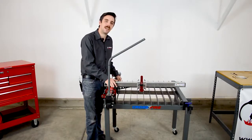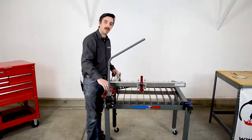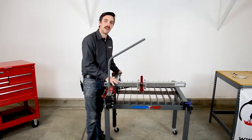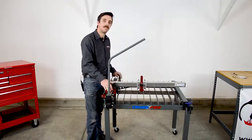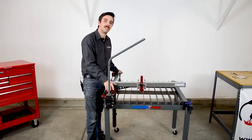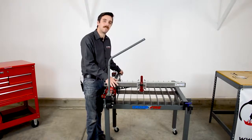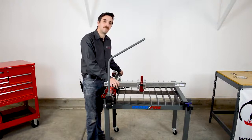There are three different ways that the machine can be out of alignment. First, the gantry tube can be out of square to the upper rail. Since we assemble the gantry assembly in our factory using a very precise fixture, squareness of the gantry tube to the rail is something that under normal circumstances you shouldn't have to be concerned with. If you do have an issue with squareness, the squares you try to cut will end up as parallelograms and the circles will end up as ovals.